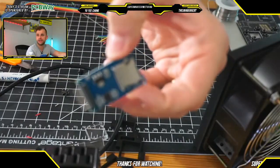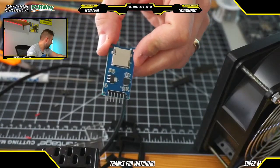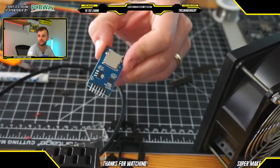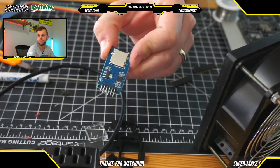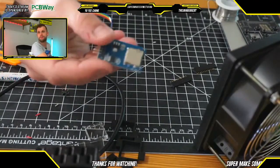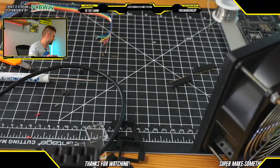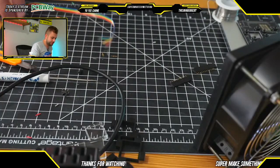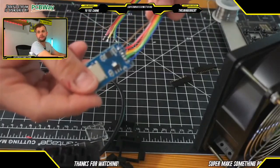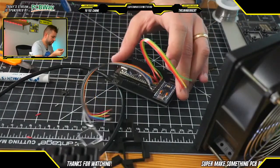Okay, next step. We are now at the part where the ribbon cable has been soldered in for the main PCB. So the final thing to do is to connect the SD card reader that we will be storing all of our icons on. In order to save some time, the ones that I bought already came pre-soldered with this male header here. Again, for space reasons, to make everything smaller, I need ones without the male header. So what I have done off screen in preparation is desoldered that male header and attached wire leads to the other side. So we'll be soldering those in now.